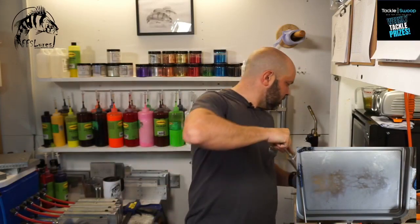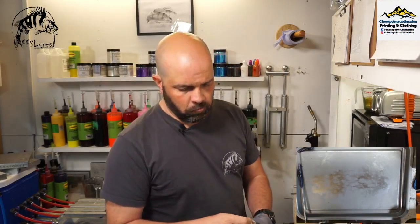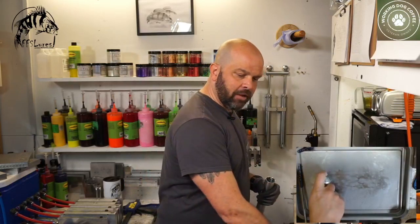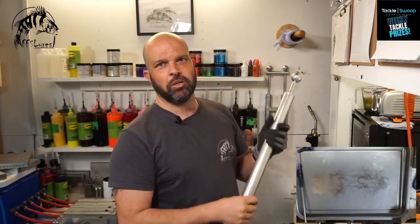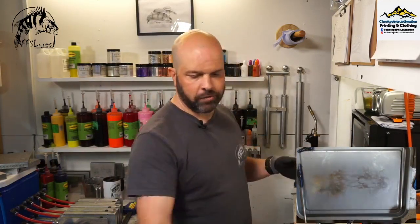One of my mold making mentors out in the States said gravity is your friend. So with this, having the cavities face upwards really helps with pouring, and also having that long runner, which you saw on the side, means I don't have to worry about topping up the sprue, so the lures won't take in any when they suck in the plastic. When the plastic starts to solidify, going from liquid to solid, it starts to suck in itself. It takes it from the runner, so a slightly oversized runner for this size of lure, and longer, so it should be a good go.